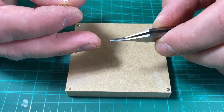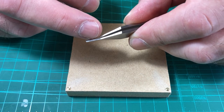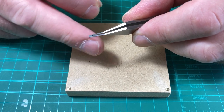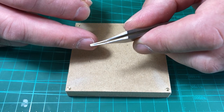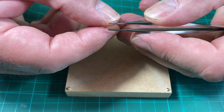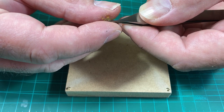The problem with the bending tweezers is when you press them together it's at a point, and then the gap opens. It grips at that point but the foot is free to pivot around the point as opposed to being parallel and gripping evenly. When you squeeze them and get positioned you have to squeeze really tight to close the gap. We'll persevere and see how we get on.